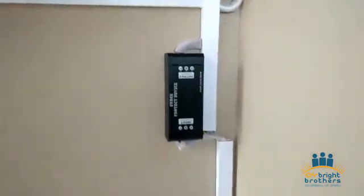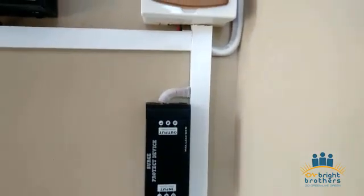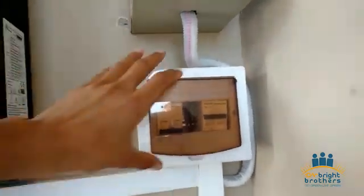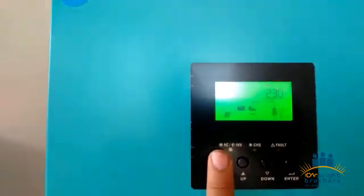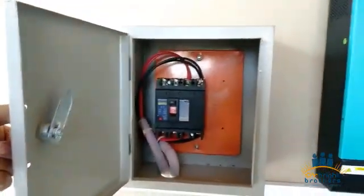And this is the surge protection device from the utility, which can save us in case of a surge. And similarly these are the safety breakers made by Schneider as well. And this is the changeover between the solar and the WAPDA. And you can see the inverter is running without batteries, without WAPDA, and the load is still running. And there is another breaker we have used here for the PV side, you can see.